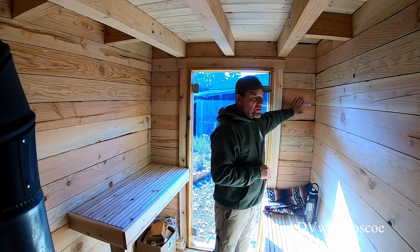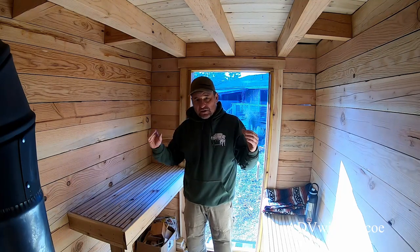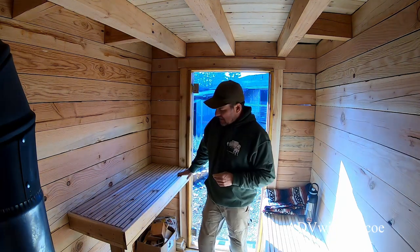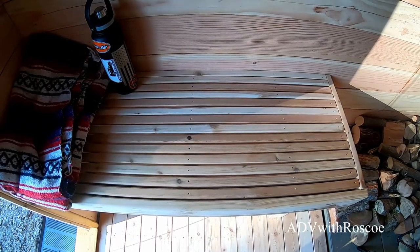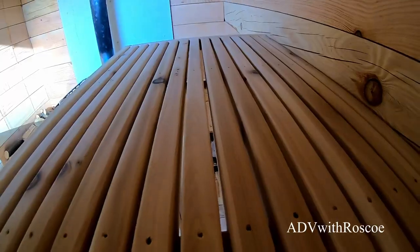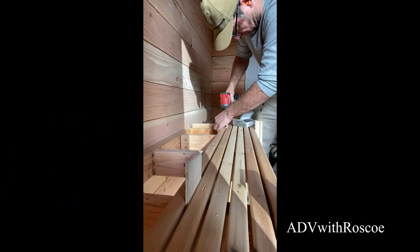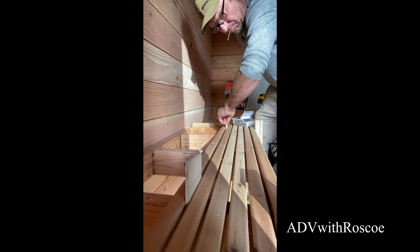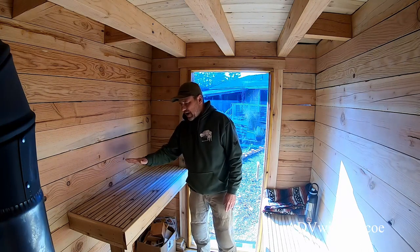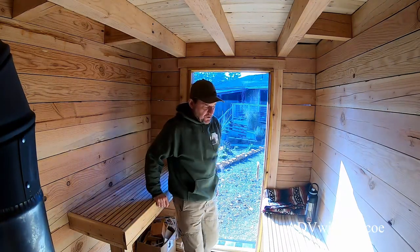As you can see, there is some light coming through — I do have gaps. I'm okay with it; it helps feed the fire. Once it completely shrinks I'm going to seal it, chink it, and caulk it on the outside. The benches I made two different heights — the upper one is obviously warmer. I took 3.5-inch cedar boards, ripped them into three equal parts, rounded the edges, and spaced them out with a quarter-inch plywood spacer. I have a frame against the side wall and back wall, so they are very solid.